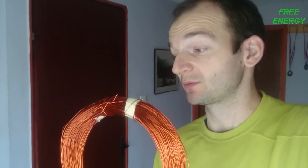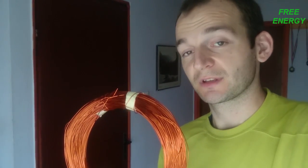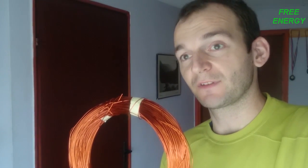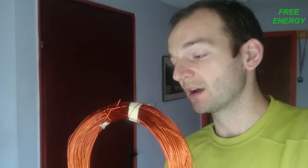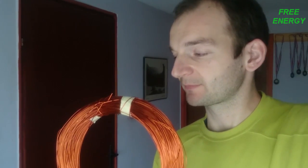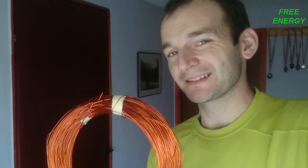I used 150 windings in one project and 220 windings in another. You can also buy the two square millimeter wire — you'll have half the length of wire but it will fit in the same space, and of course you'll have half the voltage, so you have to count on that. This particular wire can hold currents up to 20 amps, which is quite enough for our design to support the rated power.